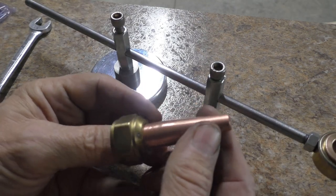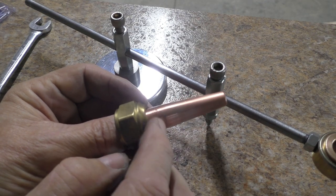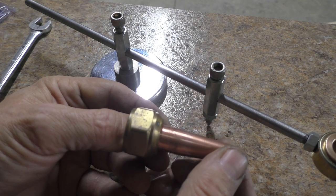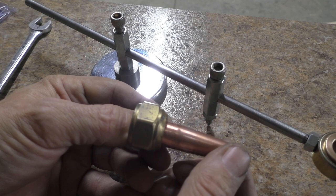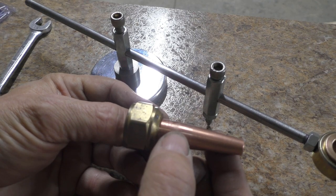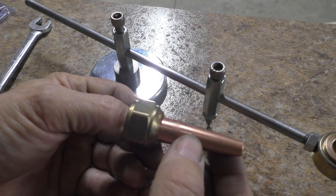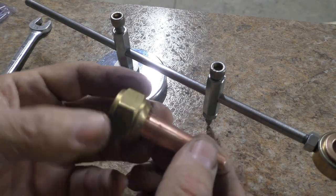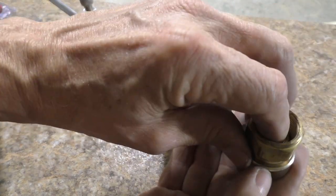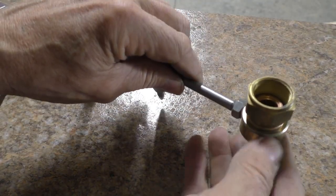Okay, this is the nozzle off of my torch, and where the identification information is stamped into it, the embossing process makes the metal rise up a little bit, so it creates a problem with fit. So I had to take a file and file down that embossing just a little bit, only enough to get the burr off that was raised up. And now that fits down inside of here, and it's a reasonably light press fit in there right now. So it does not come out easily.